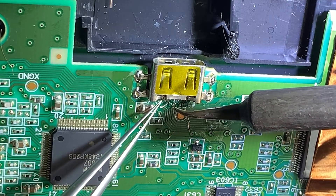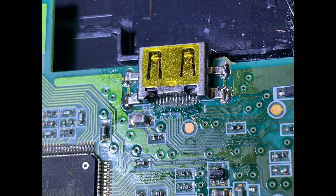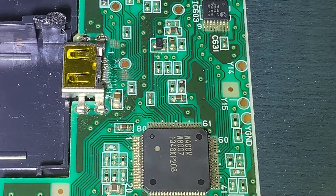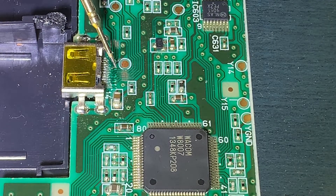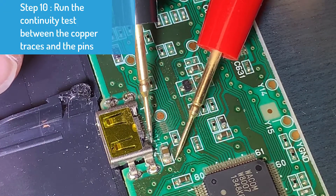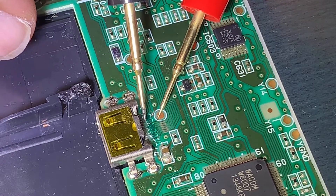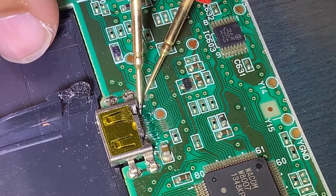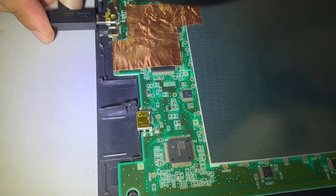To save you time from having to watch this tediously long process, let's jump to the finish line. This is what it looks like when everything is done. What I did off camera was scrape off some insulator from the copper traces so that it becomes more convenient to test the continuity between the copper traces and the USB pins. Now let's connect this drawing pad to my computer.